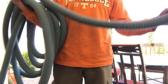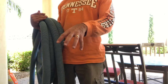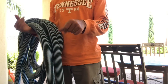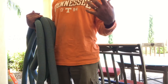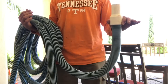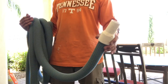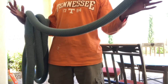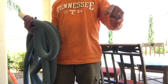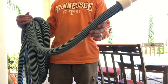The other end plugs into the skimmer. Now, if you decide you need to replace the sectional vacuum hoses on your stay-in-the-pool vacuum, don't use one of these single hoses, because this is a lot stiffer and less movable and it will hinder the movement of your vacuum. You can use this to vacuum your pool manually, or you can use the sectional ones attached to the head, but don't use this single hose for a stay-in-the-pool vacuum.